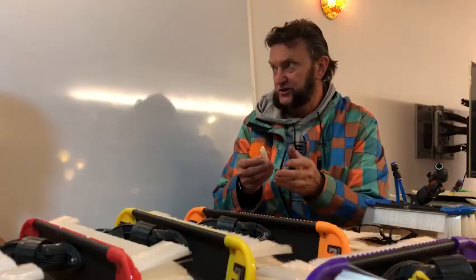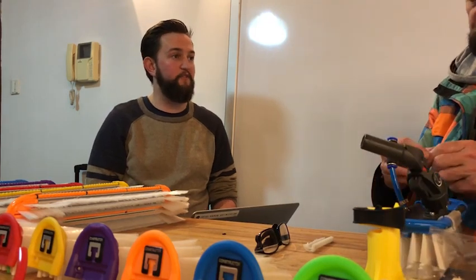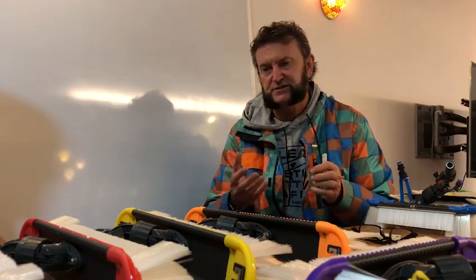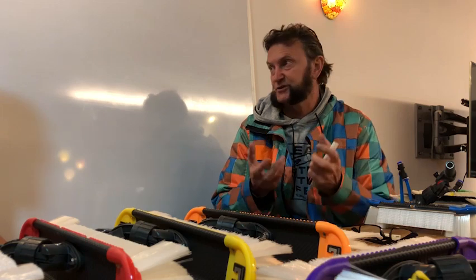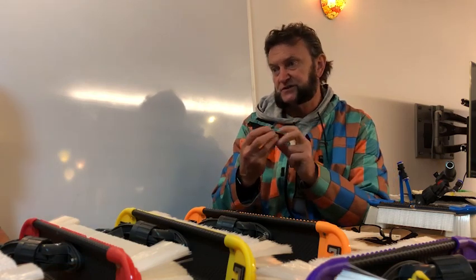So as an operator, you'll be able to set these up with every second jet open, every third jet open, every fourth jet open. Why would I need to do that? As an operator, why would I need to have every second jet open or every jet open? Right, so because the whole issue of rinse bars is that we're going from two pencil jets or 4 pencil jets to, for example, 20 pencil jets or 30 or 40 pencil jets, like hydroblade jets or rinse bar jets. And so the whole relationship is about how many jets are open, how much pressure you've got at the spigot or at the pump, and then how much resistance you have. So we're talking how much water we've got on site? No.